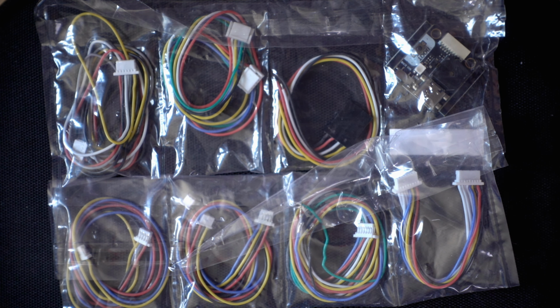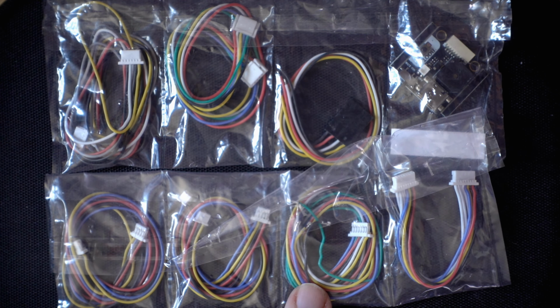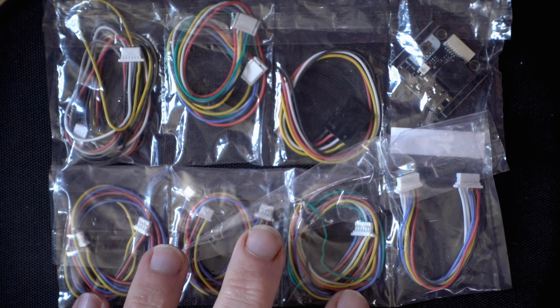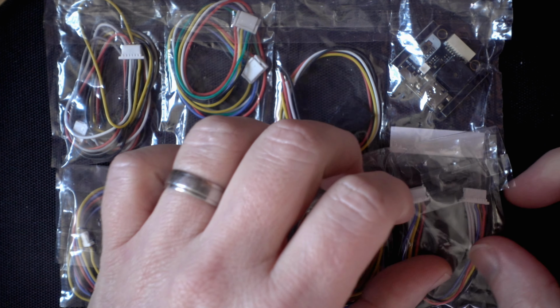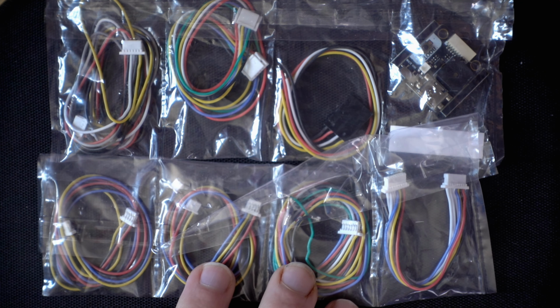So solder pads for a fixed wing is a much better idea, but the plugs also take up a lot of space. So the flight controller layout is compromised and you can potentially miss out on features because we've got these dirty great plug things on, as well as the pads for the solder joints.